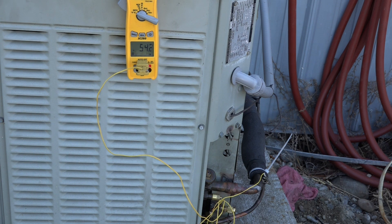I've got a wet suction line with condensate on it, which tells me it's cool but not so cold that it's freezing. My temperature inside is reasonable, the temperature split inside is reasonable, and the temperature itself inside is reasonable. When I compare this to a 40-degree evaporating temperature, I'm actually pretty close on superheat. So just by using a temperature probe or your hand, you can get a pretty good idea of how well this thing is charged without putting the gauges on.